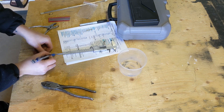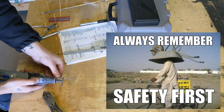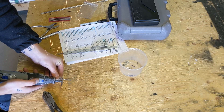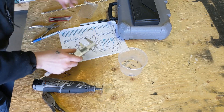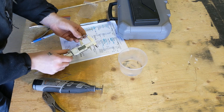The only thing is this project took way too long to print. It took two printers running seven days pretty much straight. In hindsight, that's because I was using a 0.3 millimeter nozzle for mostly everything. I probably should have used a bigger nozzle since I was scaling it up, but the instructions called for it, so I just followed them blindly.